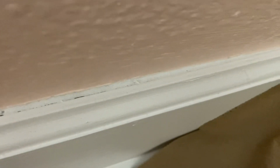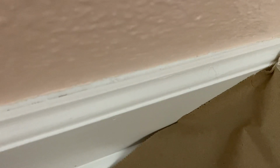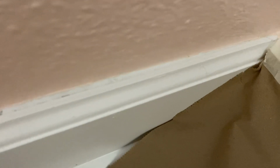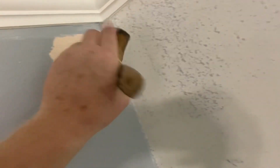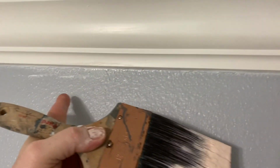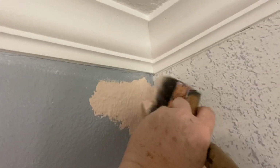When you have paint that remains from a sloppy application of paint from the previous painter, don't bring your pink paint all the way out onto the woodwork trim. Just simply touch that up with white after the pink is dry. Now, cutting the top here is a different skill set altogether. I had to caulk up here, there were cracks in there, so you'll see this whitish shiny stuff is just caulking. This is something you want to practice before you start it yourself.